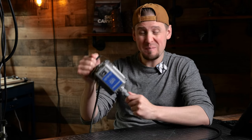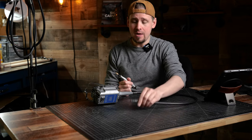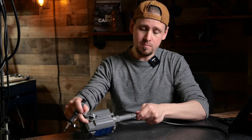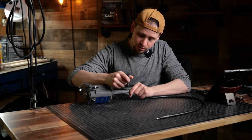So we are going to change this out. The first thing you want to do is make sure this is unplugged. Next we want to remove the removable handpiece, and for the next part I am going to take a small flat head screwdriver — you'll see a little screw right here that we want to loosen up.